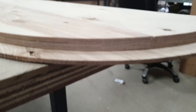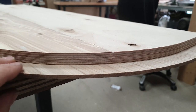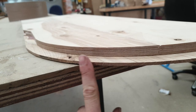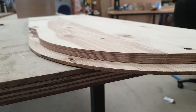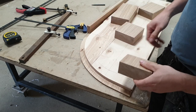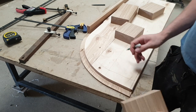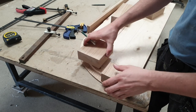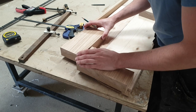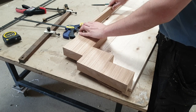Okay, so I've just gone deep enough there with the spindle to take the ply off and leave this oak. Now I'm going to attach some oak to this end grain, trim it to the face, and that'll be the nosing made up. I've got these blocks, the thickness of the finish of the nosing that I want, and I've basically cut them into sections. This one will go on the end here, and this one goes slightly around the circle like this. This one travels most of the curve like that. Then it intersects the front one here like this.